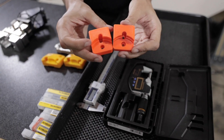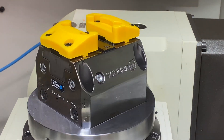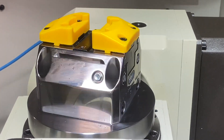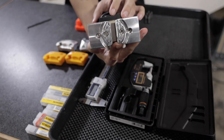To start off our automation process, we had to begin by looking at the part that we were going to make — what jaws we could put in our machine vise and what fingers we could put on the end of our gripper. We began with our engineer Billy, who 3D printed us some models for both the fingers on the end of our gripper and jaws for our chuck vise in our machine. The chuck vise is pneumatic, so we needed something that could hold our circle, and we also needed fingers on the end of our robot gripper that could hold our raw stock and our finished stock at the end of the operation.